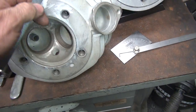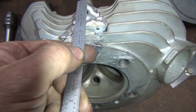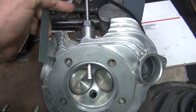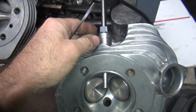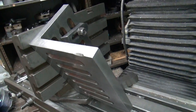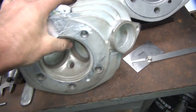So what I'm going to do is put this head up in there, center it up off these studs so it sits flat. Before I was doing an angle in there and I was screwing everything all up. I'll come off the center stud, which will give me equal distance on my pushrod cover so that should fit better. Because on this one we were too close because of the way the angle is done — they had this thing cocked like this, which puts this side closer to my pushrod cover, which I didn't like. I just duplicated that head when I made the other head. So now I'm just going to do it how I want to do it — figure this out myself. So I'm going to go ahead and get everything all centered up off the stud, then look at my offset and see what I want to do. I'll have to do that off camera because I can't hold the camera and do all this work. But that's how we figure out where we want that spark plug.